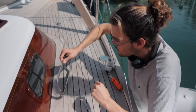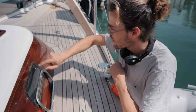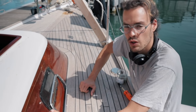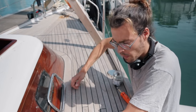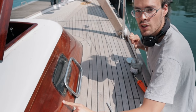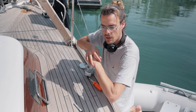The only thing I can tell from here is these bigger damages — the cracks. This was from when the boat fell down from the crane. The ones by the window are pretty typical for wooden cabin tops: the wood works and moves. Sometimes a crack can also be provoked by putting in a screw without drilling a pilot hole first, stressing the wood. I've epoxied the crack and varnished over it, but only from outside, not inside. I can see tiny little hair cracks sideways, meaning it's still moving and the epoxy hasn't fully stabilized it.